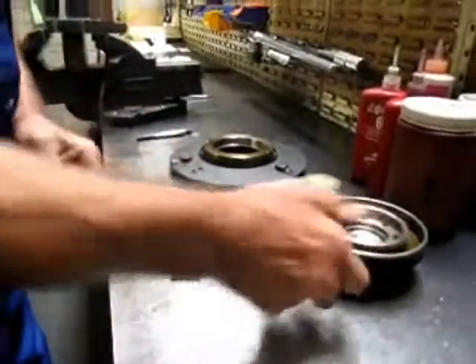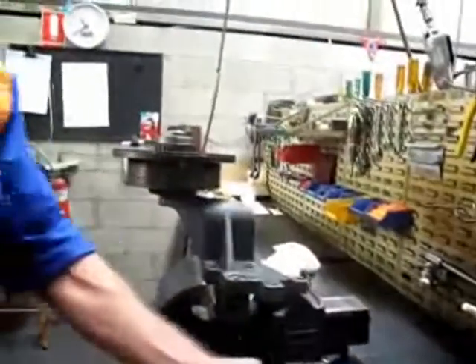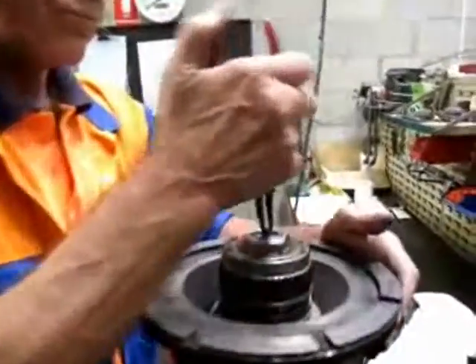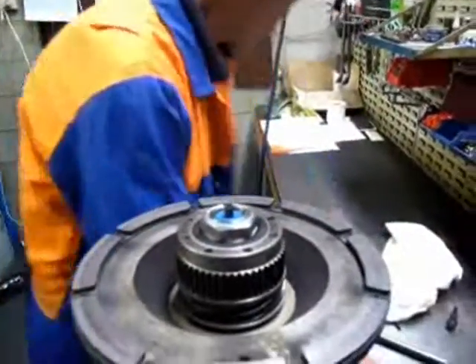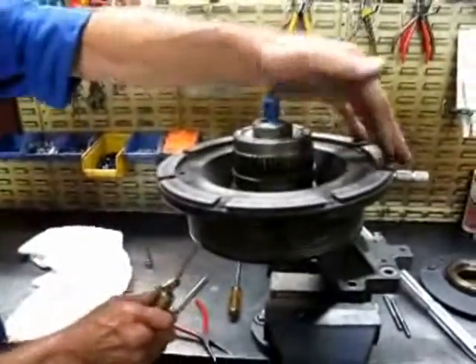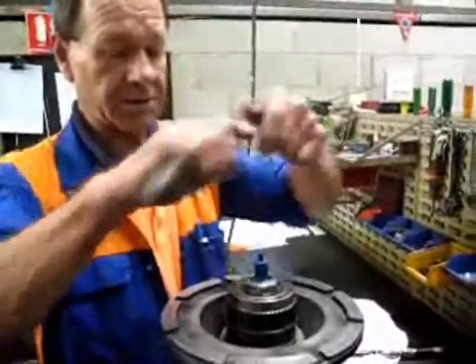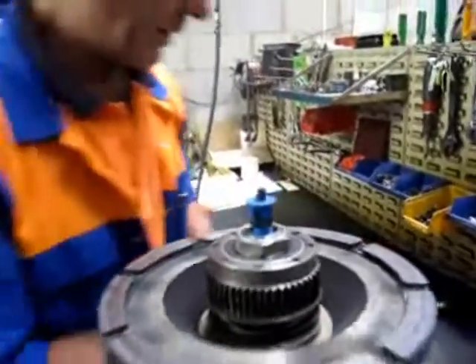Ok, move to the other side for a moment. What we do is take the cartridge out. With compressed air, just cover the hole. If you haven't got compressed air, very gently with a pair of pliers, pull that up until you can get a screwdriver under the top of the cartridge, and that'll get it out.